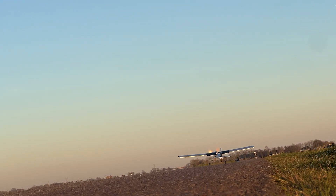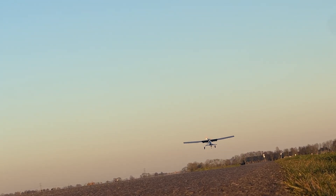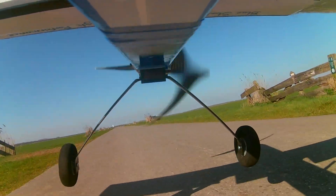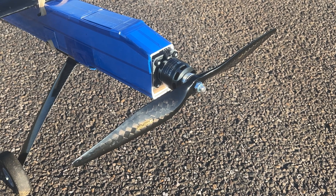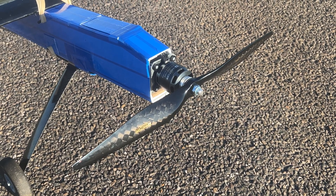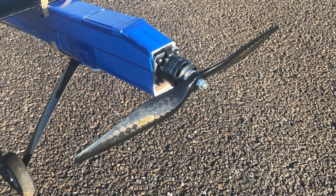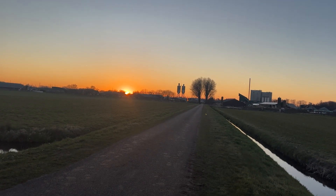This of course challenges the pilot to master yaw control during ground roll, takeoff roll, and rollout after landing — but not too much, as the rollouts are short anyway because the aircraft has more than a 2-to-1 thrust-to-weight ratio. The power plant on the aircraft is the T-Motor AT4120 brushless outrunner with a 17-18 inch propeller size option on 6-cell, to suit different flight styles, payload options, and wind conditions.